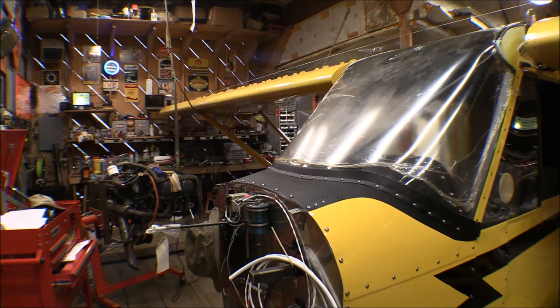A disconcerting thing was I went ahead and checked my dihedral, and it raised both wings about a 16th of an inch, so now I've got 3¼ inches of dihedral showing. I'm not sure exactly what to do about that — I think that's too much to take out with one turn. I'd have to take one turn out of each one of them.